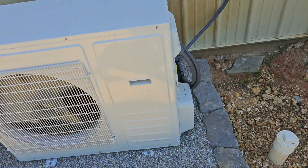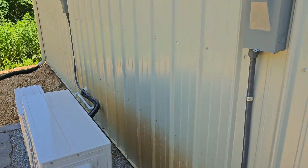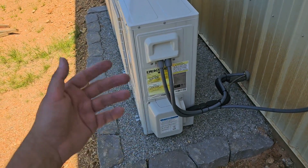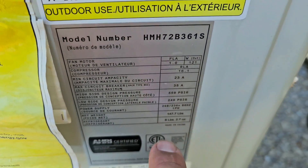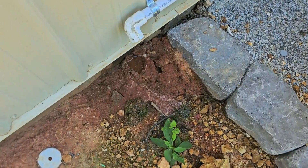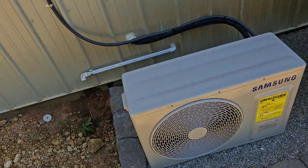If you need a very good durable metal cover for your line sets, this is the unit for the rest of the house — an HMH7 York modulating variable capacity outdoor unit connected to a horizontal air handler. It's a three ton, 36,000 BTU HMH7. The most important thing a contractor can do is make sure that the drains are draining out water, because if it's not draining out here, it's draining out somewhere inside. You don't want that.